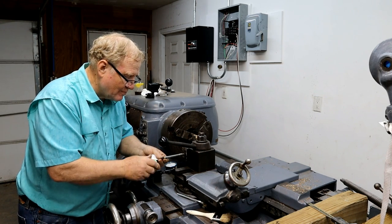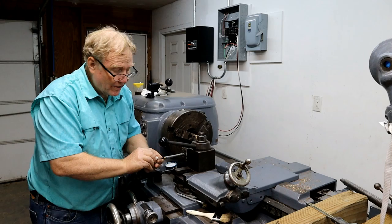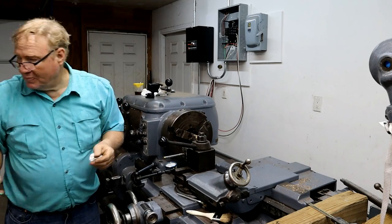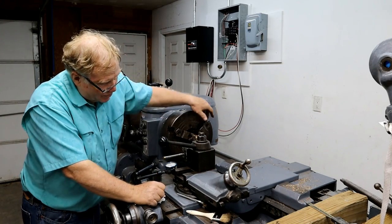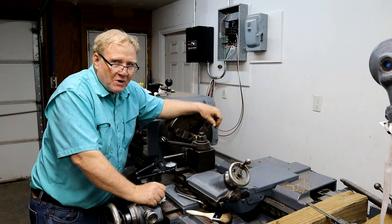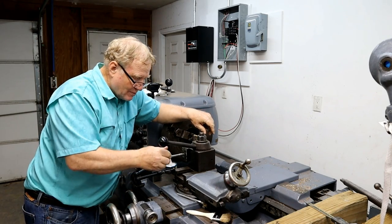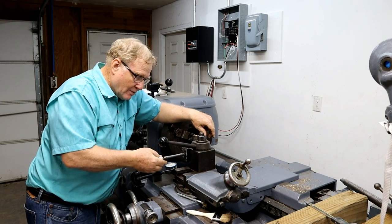So I was thinking, you know, Loctite. That'll keep that screw from coming out. Yeah, forever. The people that I respect said Loctite isn't a good idea. If you can't get that screw out of there, which you probably can pretty easy, but it's more important to grease the screw, or use anti-seize, which acts as a lubricant, so that you get the correct amount of torque holding that screw in.